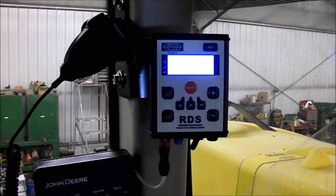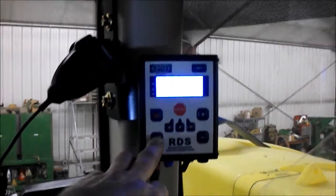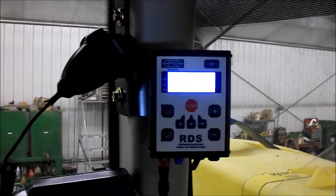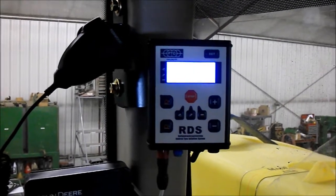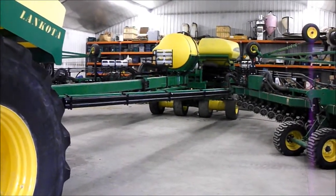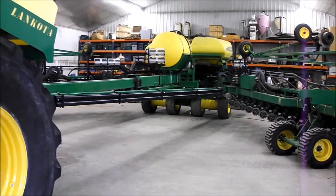When that's done, you can go ahead and lower your air pressure. Go ahead and hit your axle and then your field position, and whichever pressure you set in there. We set 38 pounds for field, 90 for the road. You always inflate a tire to the load that it carries, but go ahead and switch to field position and make sure that the end result is the system will say okay when it's all done. This may take several minutes. Once you've checked everything for leaks and everything works both in the field and road position, the correct pressures and the set points work correctly, you're all done.